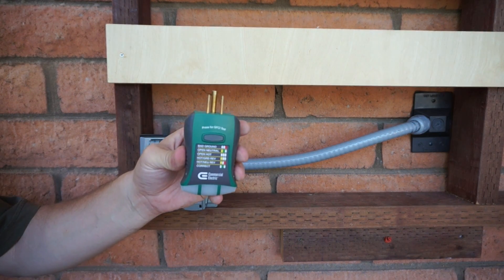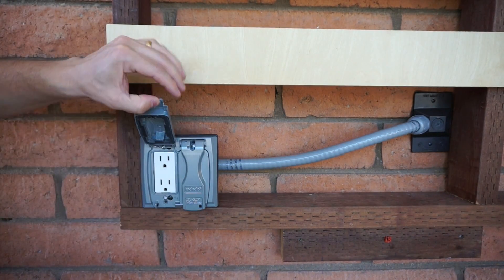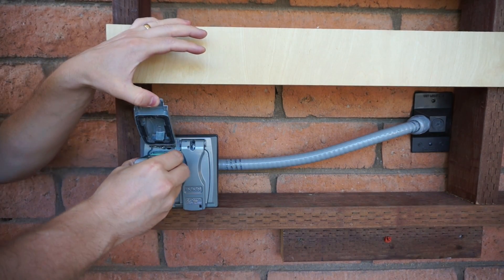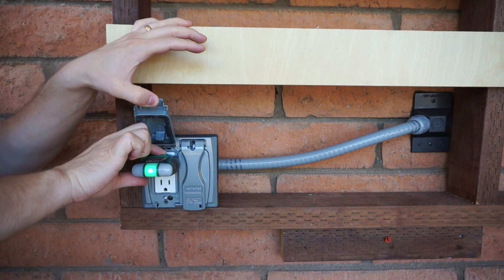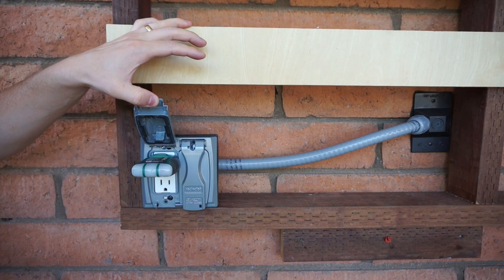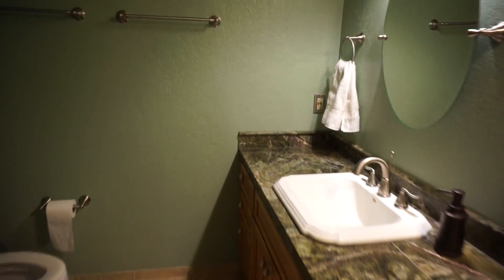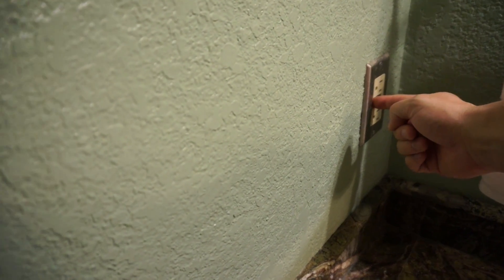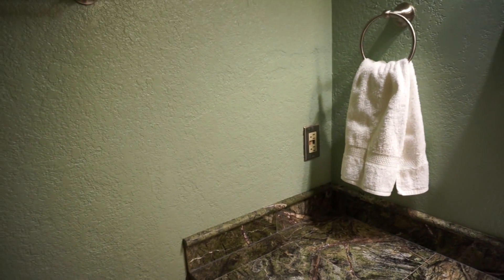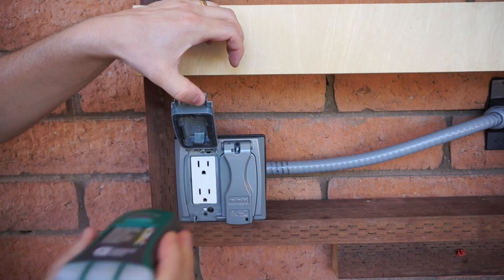Yes, it's true that I used regular outlets and not GFCI ones here, but it is on a GFCI circuit, and that's actually what matters to the code. I wanted to show that this is actually on a proper circuit. I used a GFCI tester, tripped it — and there we go, it tripped when it encountered a ground fault. Here's where I have to go to reset it: it's at the beginning of the circuit in the bathroom. Reset — and if I go back to the outlet, I can verify that power is restored. It is on a GFCI circuit.